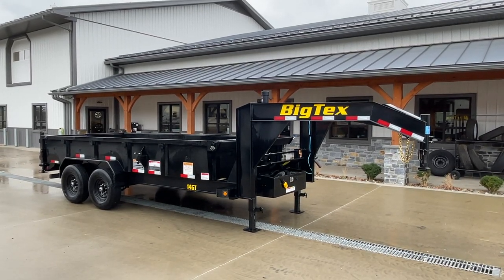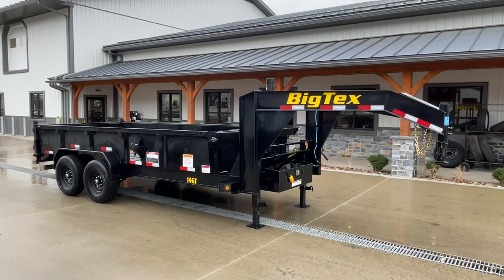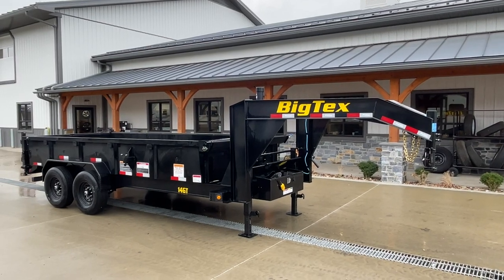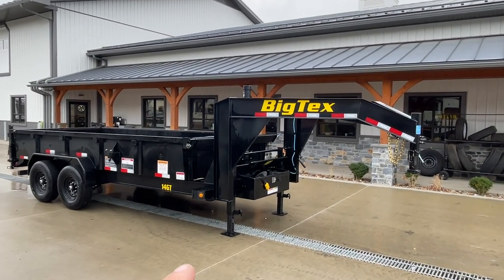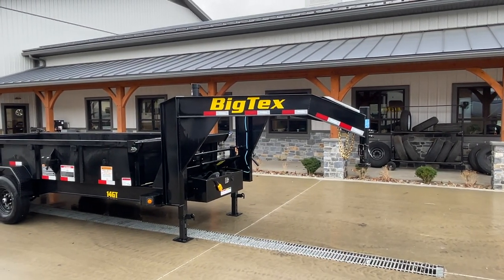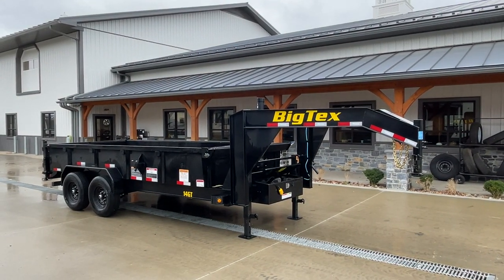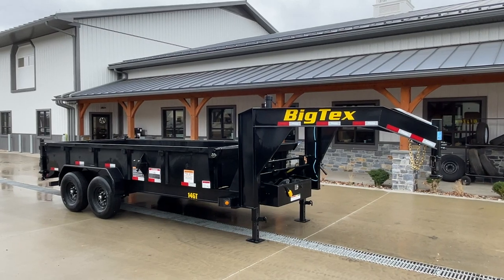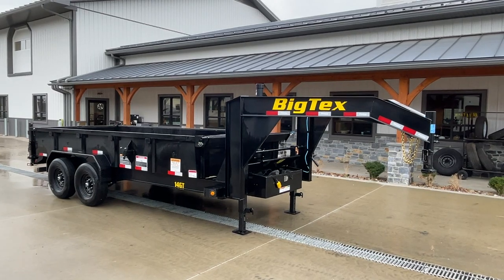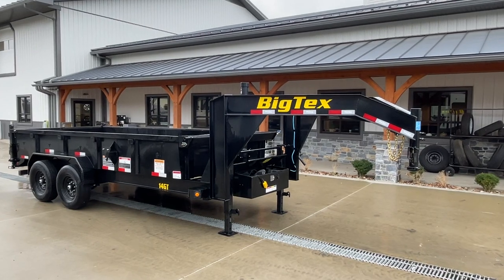Telescopic dump is newer to Big Tex and the industry as a whole, so this has a telescopic hoist upgrade. It is 16 foot in length, 7 foot width, and it's a 14,000 GVW — but this one they've actually counted tongue weight, so they're going to rate this at 15.9. They're putting 1,900 pounds on the goose, which is actually a conservative number. Typically the actual is more like 22% or 3,000, so this is underrated by about 1,000 pounds. Their net payload on this unit is going to come in at about 11,000 pounds, which you can legally haul, and it's probably 1,000 pounds or so on the conservative side.